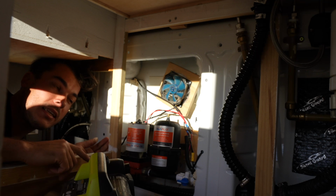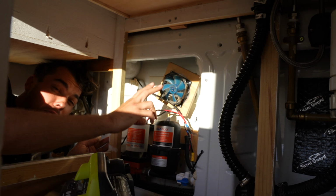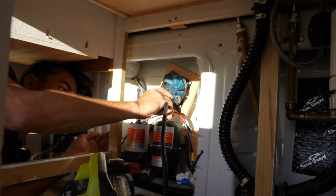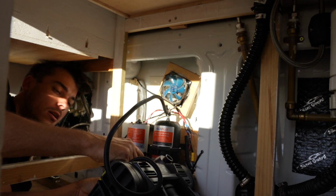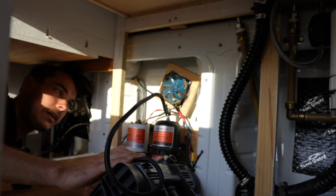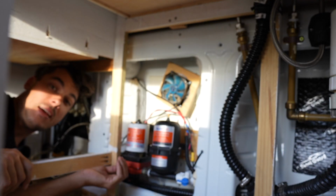If you are doing this, you have to make sure that you first turn the pump off at the switch and also open your tap to release the pressure in the tank. So I'm going to pump this in. Turn this to 50 psi. Okay, so the accumulator is now set up to 50 psi. Let's now turn the tap on and see how it all works.